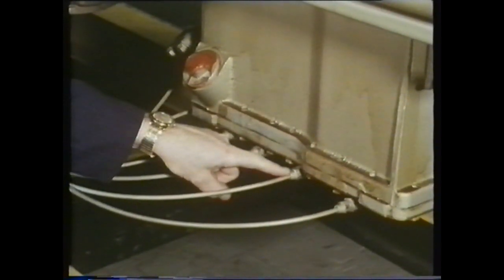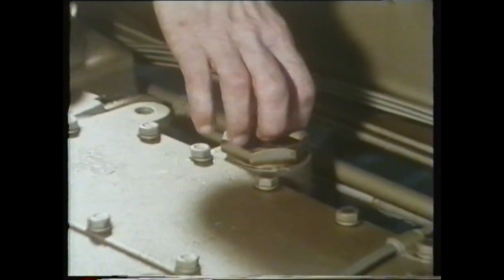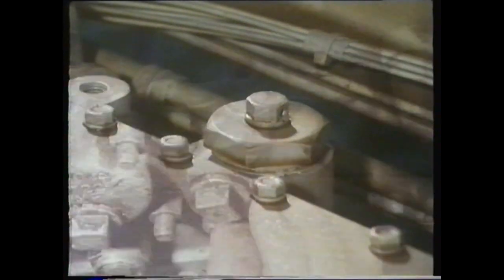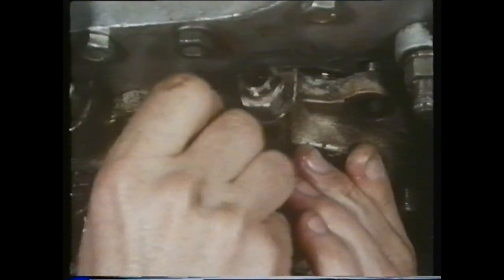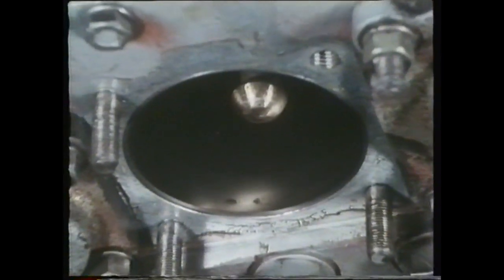If we now assume that air is present at the inlet to the gearbox when you make the first check on a fault condition, proceed in the following manner. First, apply second gear and return to the gearbox area and check the breather like this. If air is present here, it's a clear indication that the second gear piston seal isn't functioning correctly, thus providing either a no-drive or a partial slip condition in second gear. If air is present at the breather, remove the piston from the cylinder by removing the four screws from the base plate here. The piston assembly can then be lowered and removed for inspection. Of the two seals on the piston, this lower one is the air seal — both seals should be replaced. While the cylinder is exposed, always inspect it for scoring or cracks on its surface.